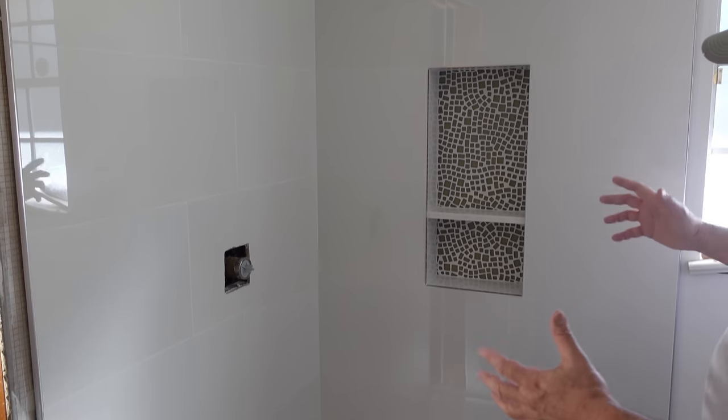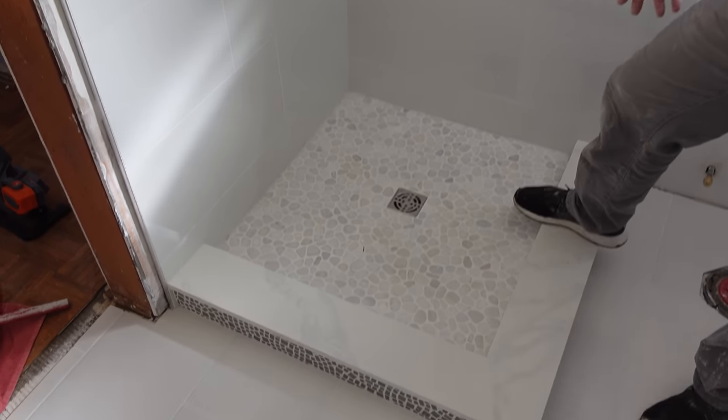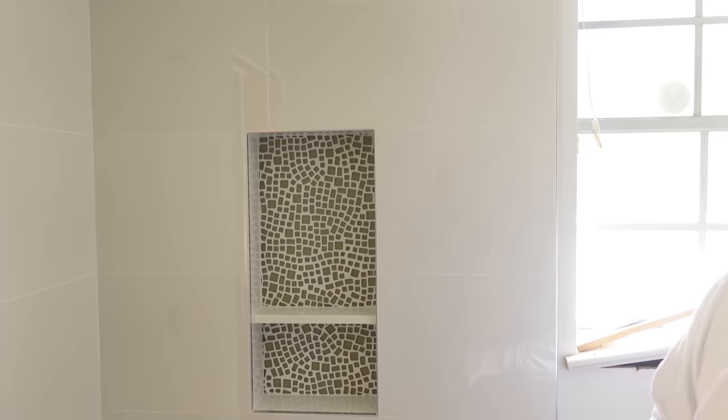There you go gang — the shower, the niche, and the floors in both bathrooms are all grouted, and we are beat. I'm soaked. That's hard work. It took both Jordan and I to put that grout down. I was working in that bathroom and he got started in this one, because the second bag we mixed was like a separate batch of grout. The first one was perfect, but the second bag — even though it was the same temperature water and same temperature powder — it just went off a lot faster. Same mixing, everything. But that's the nature of grout: you've got to stay on top of it. Doesn't that look fantastic? We are so excited that the tiling is done. Make sure you smash that like button for Jordan and I — we really appreciate it. Click down below in the comments, ask us your great questions, leave us some comments, please subscribe if you haven't already, and we will see you on our next video.